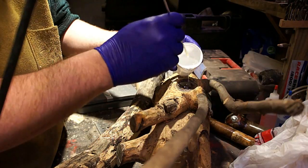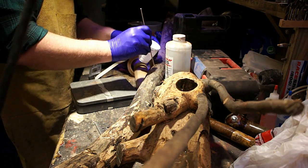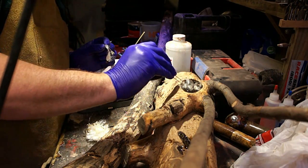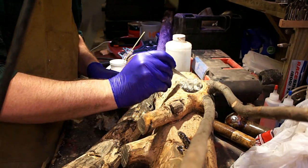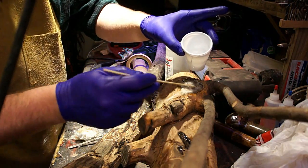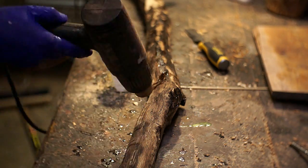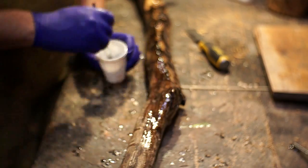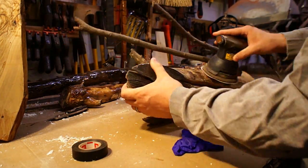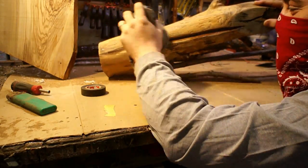Because I love playing with epoxy, of course I had to do it here. There are some structural parts I was filling with epoxy — I liked that crack on the back and wanted to fill that end to make sure it was super strong. You can see me filling in a couple of holes. The other thing I'm doing is embedding butterfly milkweed seeds in that middle part — they have a really cool airy texture, and I was trying to capture that since this area faces forward on the shelves. With them positioned in there, just a little bit more epoxy over the top smooths them out so they kind of float up into the workpiece. I'm heating it up so the epoxy gets a little further into the grain — just experimenting. After the epoxy cured I knocked down all the spots and worked my way down through all the grits to get the bark smooth.